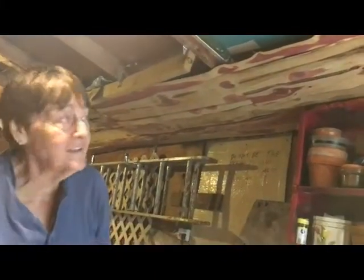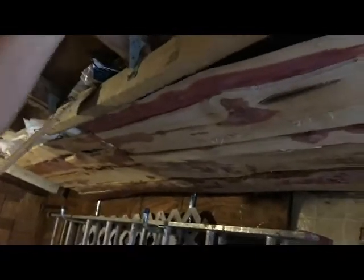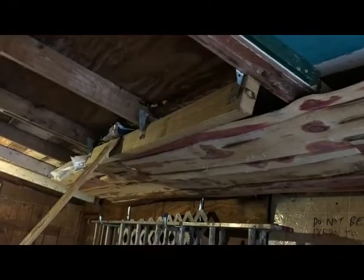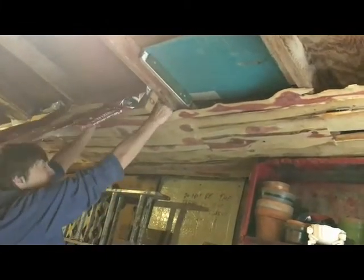Right now you're like 'I don't see any real damage' - this part of the ceiling, all that crap stuck in there - this whole thing had rotted out. When I put the new roof on I put two boards this way across the top of the old roof and then put my sheet iron on that. Right now I'm taking some feed sacks, cutting the bottoms off them, and just sliding them underneath as an extra vapor barrier and a little bit of insulation.